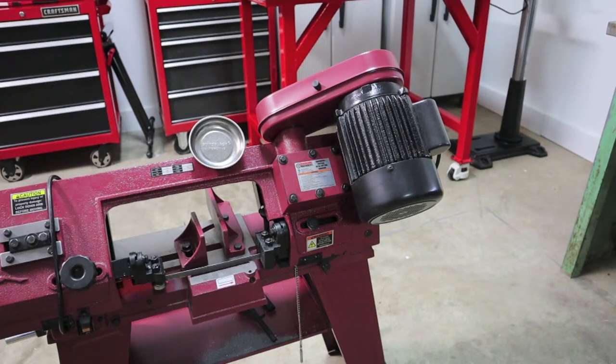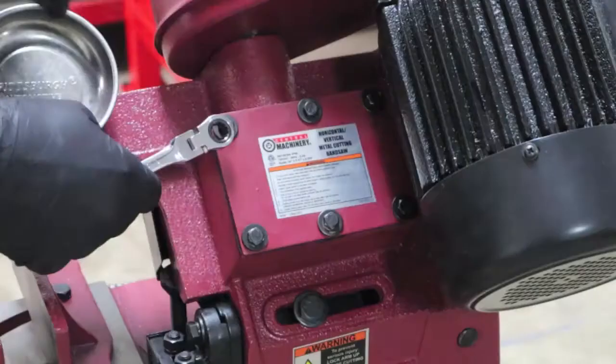This saw has made the welding table. It's made all the cuts on the welding table behind it, and plus numerous other cuts for the caster plates. It cut all those out. And I feel like it's got enough time on it, so we're going to go ahead and change the oil in it. And we're going to go back with a straight 140, which is kind of hard to find, but I'll show you what I'm going to use on it. We're going to go ahead and remove the cover.